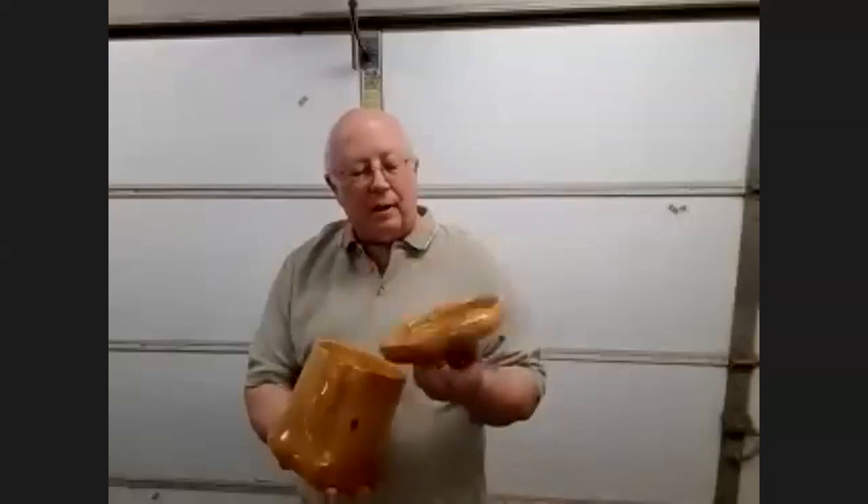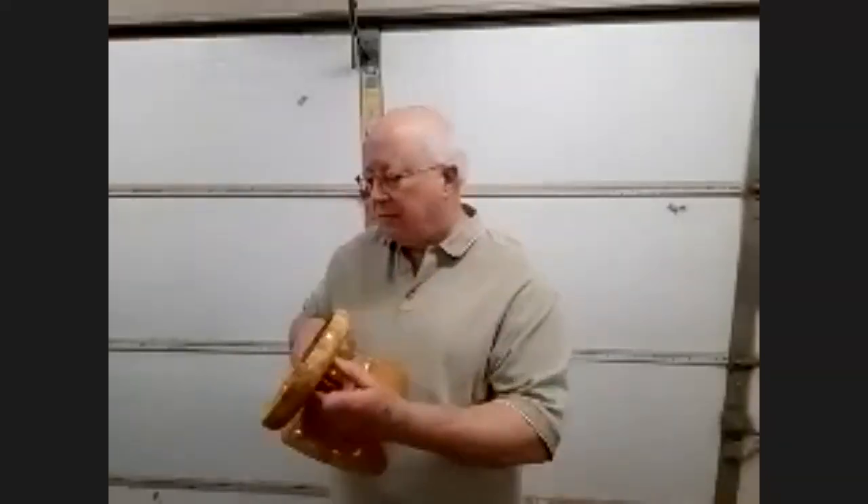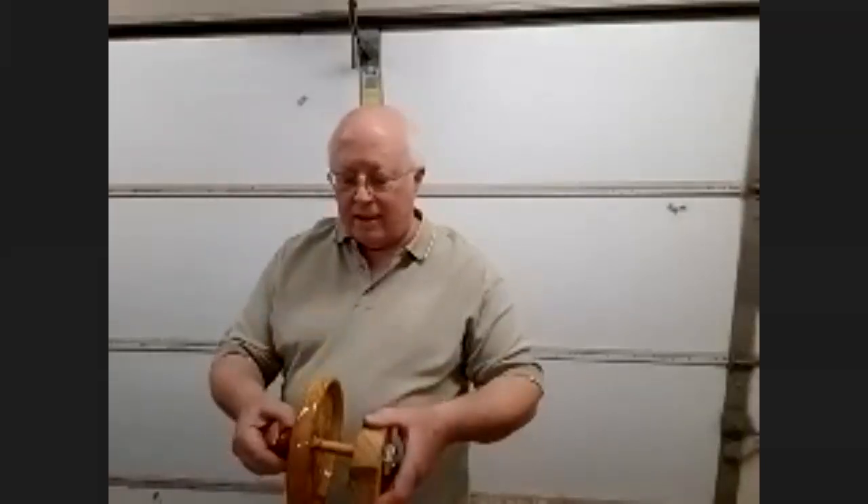This is a separate piece that I glued in here, and I wanted them to be epoxied together — I wanted that seam to have epoxy over it and not really be visible. How I held it was right here in the center. I knew I was going to put a bead in here, so I could drill the hole and put saran wrap around the dowel and shove it in the hole. That's how I held it on the jig — just a scrap block, a glue block. I glued that in and was able to turn this thing, and you put a brush on it with the epoxy.